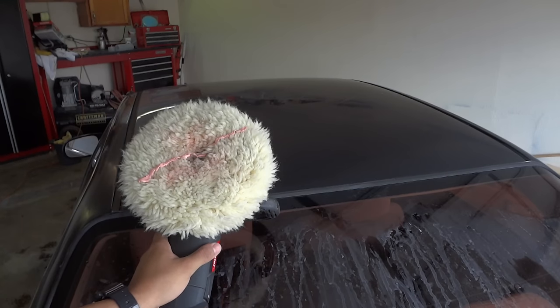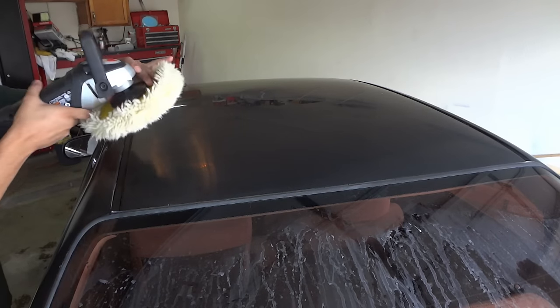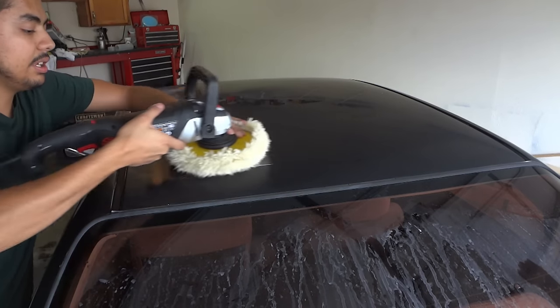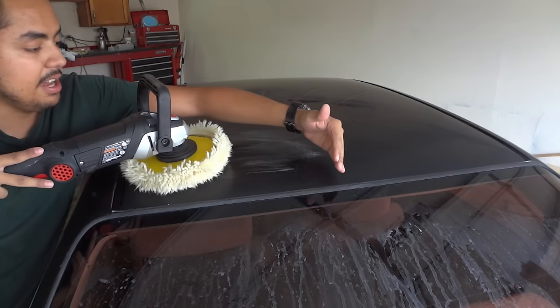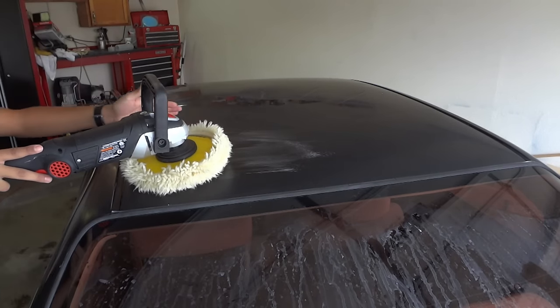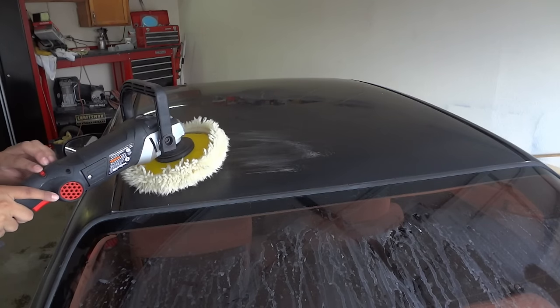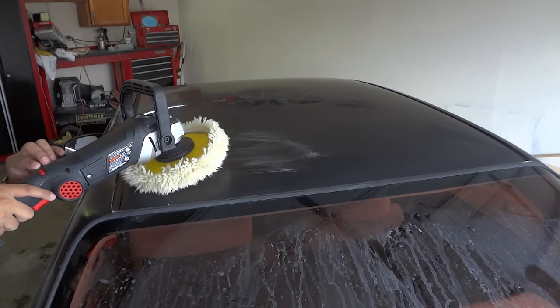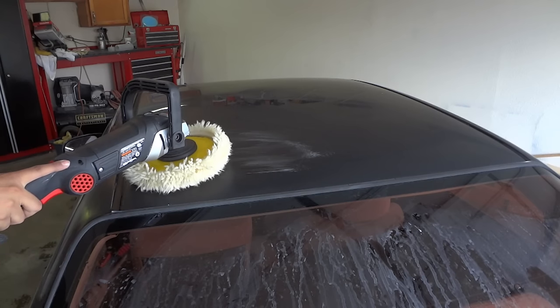What I like to do so that it doesn't splatter everywhere — I'll put it flat and hold the disc and move it around like that just to make sure it gets in there. You're going to be doing about a foot and a half of area per ribbon of compound. Your speed — I'm going to use it at three. If you're not too used to using this, use it around 1.7 until you get used to it.